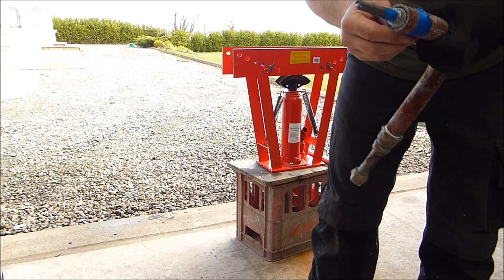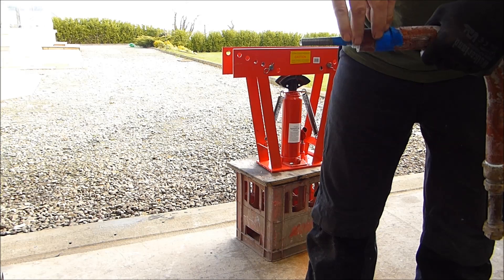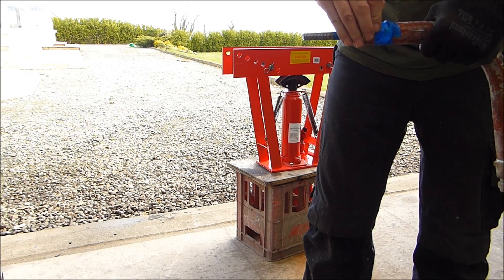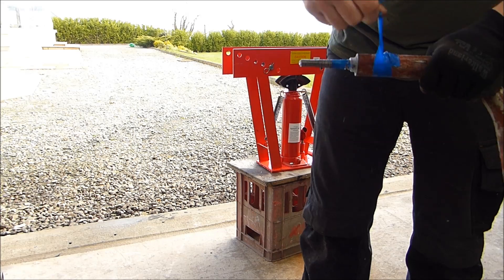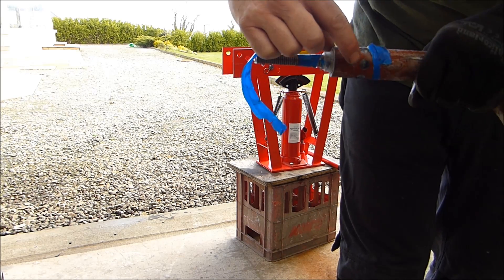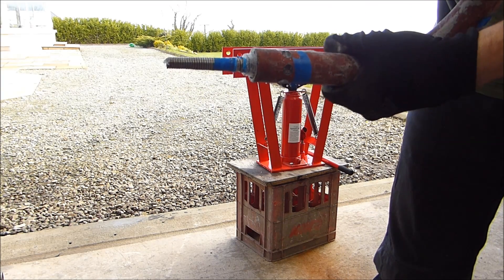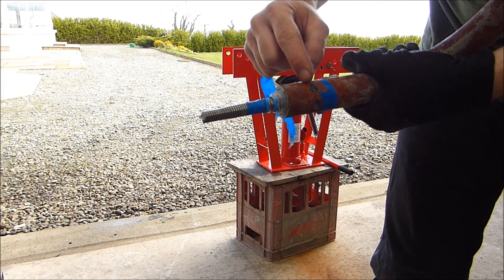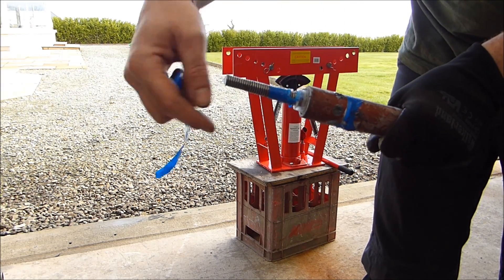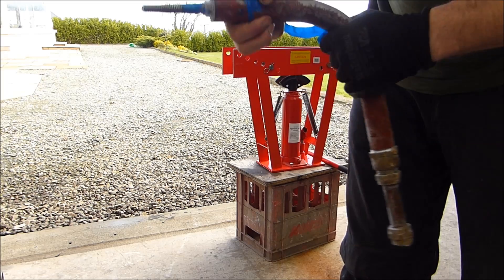I'll try to remove the tape. I drilled some holes in this at 60 degrees apart. I can see them but I don't know if they show up on camera. Can you see the ice there? So as I said, I filled this thing with water and now it's all ice. I'm going to have to wait a while for the ice to disappear. But essentially what I've got is six holes at 60 degrees apart, all the way around, about an inch and a quarter up from the bottom. The deal is I'm going to cap the end of it, allow the copper pipe to come through - like a washer with a half-inch centre, so it's going to be quite a tight fit around the copper - and it's going to be welded to this.